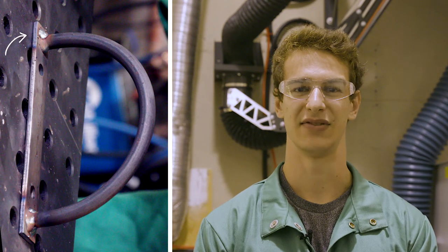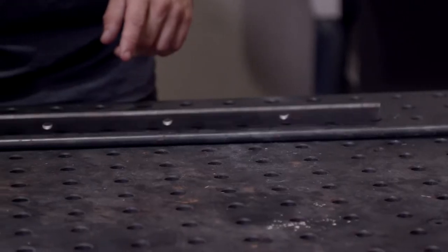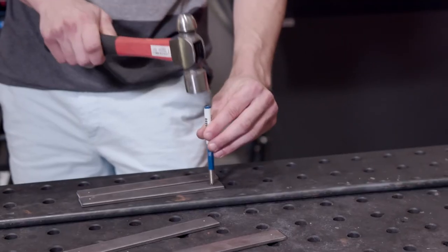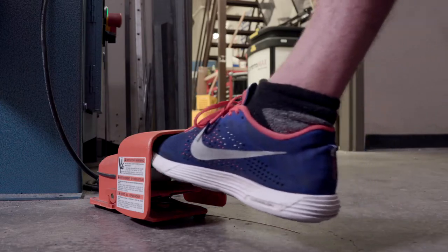Today I'm going to be creating a primitive door handle, which will consist of a flat piece of steel with mounting holes drilled in it, welded to a 180-degree bent steel rod. To create my door handle, I first cut down a long piece of flat steel stock to the correct size. I used a center punch to denote where I wanted holes, and then I used a hole punch to actually create the holes.